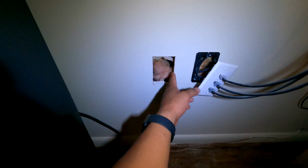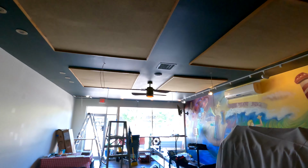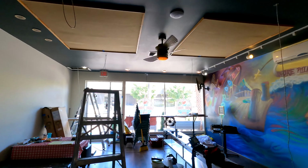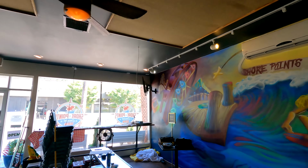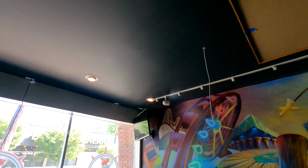This is going to be our audio port where all the lines will come out. So this is the origin for all the circuits. It's going to go back to the 2 Sonos amps wired into this cabinet, and each of the destinations is each speaker. So once you establish your origin and destination for the circuit, you can then build the circuit between the 2 points, which is what we've taken the liberty of doing.